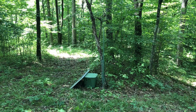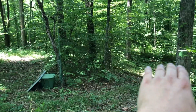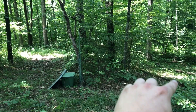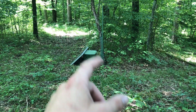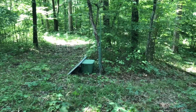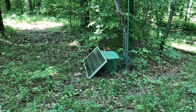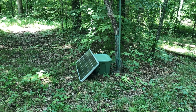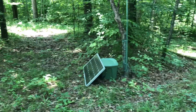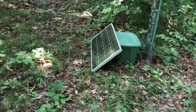Well, there it is. I guess it blends in pretty good aside from the giant solar panel. But it's kind of down low and we're on a knoll right here, so if you're down in there you probably won't see the solar panel unless you come up. That is a 100-watt Renogy 12-volt monocrystalline panel — I need a smaller one. There's no way I'm going to use 100 watts up here; that thing draws hardly anything. It can go several days in partial shade. All those leaves are going to be gone in a few months anyway, so I think it'll be okay.